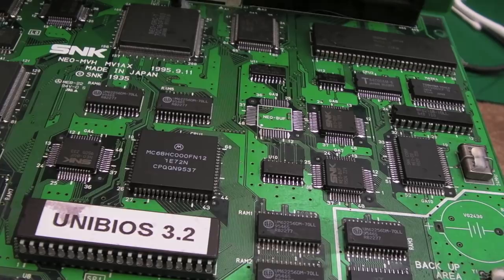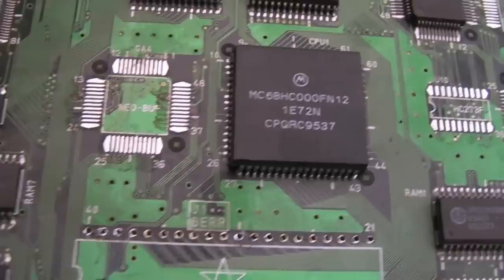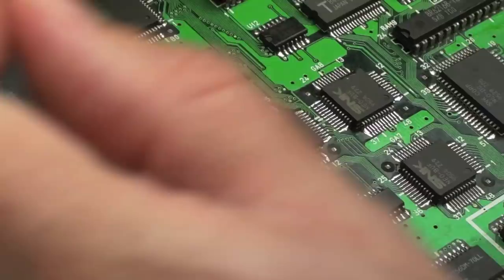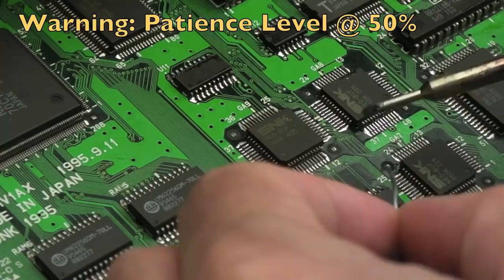This one's still here, needs a socket, so I might just move on to that one. But it's got a lot of chips missing, just like the other one has. But I suspect on this board, when we get the 259 back on there, it may give us something. So I do hope this one works on this board. It's the Z80 position from the grey screen board.